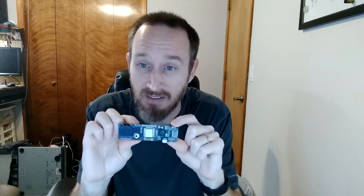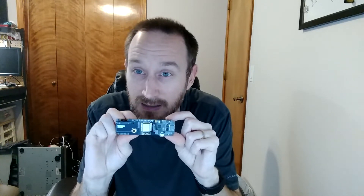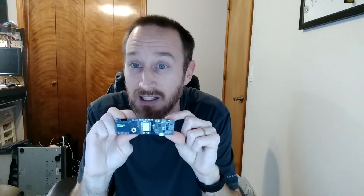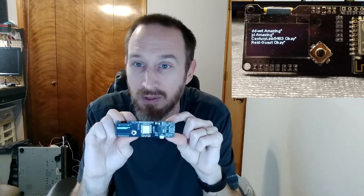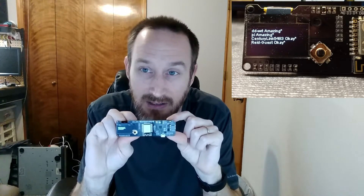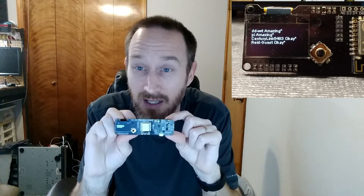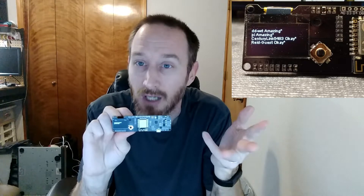One of the other things I really like about Arduino-based devices like this compared to a Raspberry Pi is that as soon as you power it on, it's on — it doesn't take 15, 20, 30, 45 seconds to power up and start displaying information. I had this programmed specifically to scan the SSIDs in my area and give human-readable information back out. Instead of displaying negative 70, negative 67, etc. for signal strength — which means nothing to most people — I converted that over to labels like awesome, good, not good, unusable, and so on.